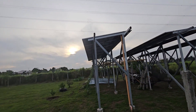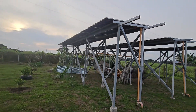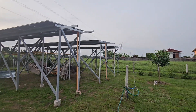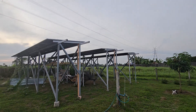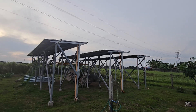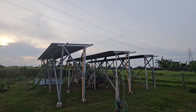This is 16,000 watts of panels and it gives me a lot of power even on a cloudy day. On a full rainy day I get zero power and have to switch back to the grid, so I use the grid as my backup — no generator. I'm 90% off-grid because it's sunny here nearly every day, and even on a cloudy day the batteries charge up by end of day. Usually by noon on a sunny day the batteries are fully charged.